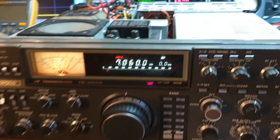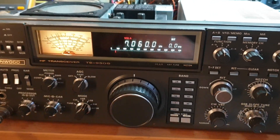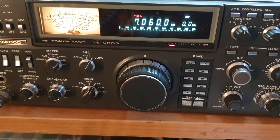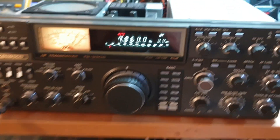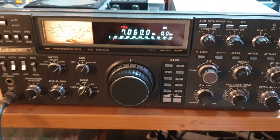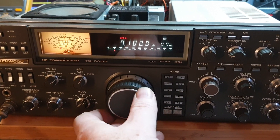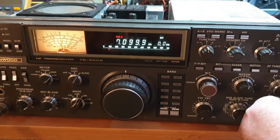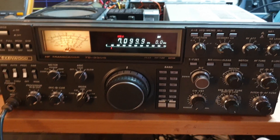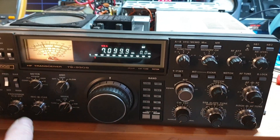Okay, one last problem - I don't believe this, but have a look at this: nothing on mic test. The mic gain - sideband etc. is only working on processor mode. VK3 Charlie Mike testing 7060, just for identification. We'll go back to dummy load in a second, but I just wanted to hear the receiver was still working well - and the receiver is working well. Keep in mind I've got quite a few screws out still because when I'm testing like this I'm almost ready for it to go wrong.